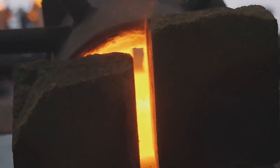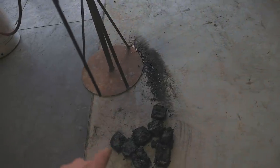Meanwhile, back inside the workshop, I've got Will's forge lit. We've got the power hammer warming up right here. I've got two blooms in the gas forge, about eight down there. And very gently, I'm gonna start working them down and processing them, consolidating them into a more solid mass. They're very spongy and porous right now. We've got to forge weld them back into themselves, work them down, and do a whole lot of that to refine this and make this into steel suitable for our cavalry saber.